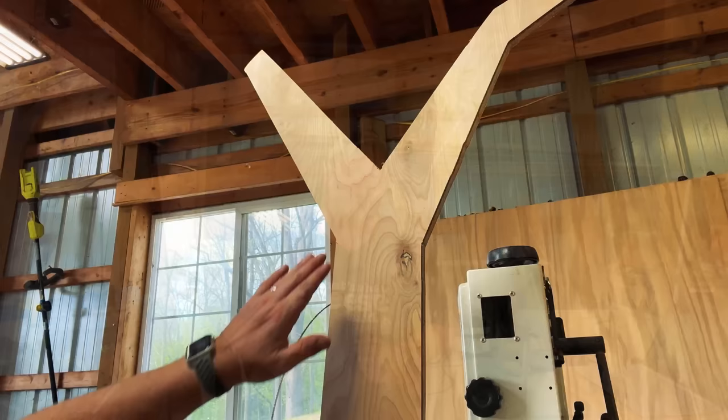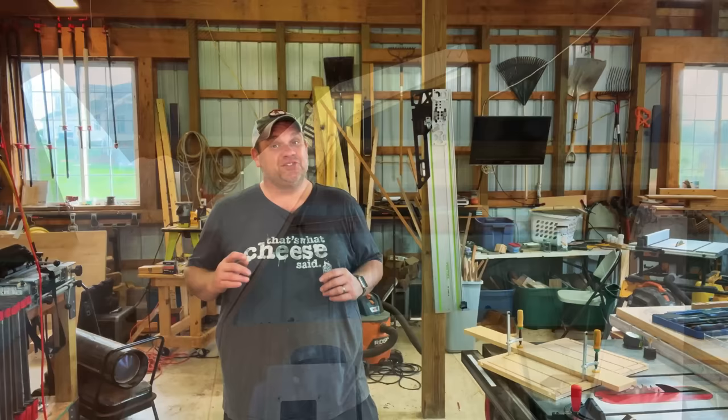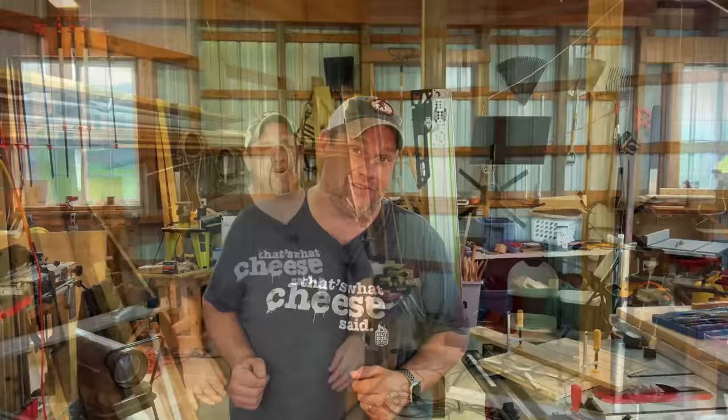I'm looking for a more subtle shaping tool — something that can smooth out a curved area without removing a whole lot of material. If I were to use a rasp where these tree branches split, it would absolutely rip apart the material. That's why I find myself using a sanding block with contoured profiles instead. I prefer the Milescraft Sand Plane, which comes with a couple of different contours that fit my sanding needs. There are a bunch of different sanding blocks out there with different contours, so find one that works for you. Sanding blocks like this allow you to get into tight spots without removing a whole lot of material.